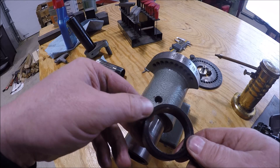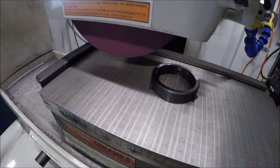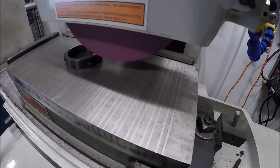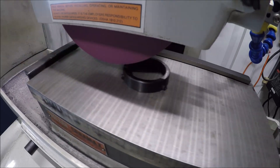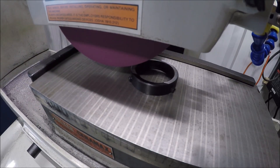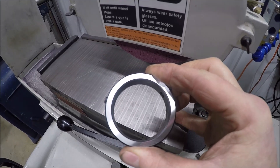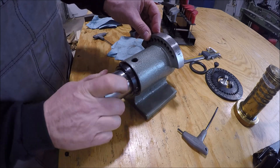I'm thinking if I go ahead and just dust off this face on the surface grinder, that may help reduce some of the friction in there. Just got wrapped up - you can see the surface finish looks really good, feels a lot better too. Let's get over there and try it out and see if that helped. And that did seem to help - it is a lot smoother, it doesn't have that catch point anymore.